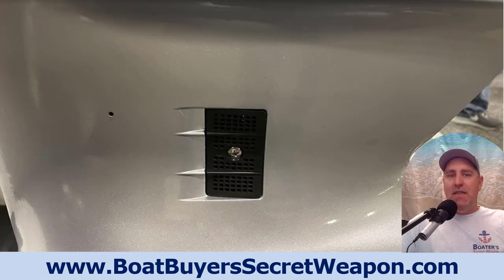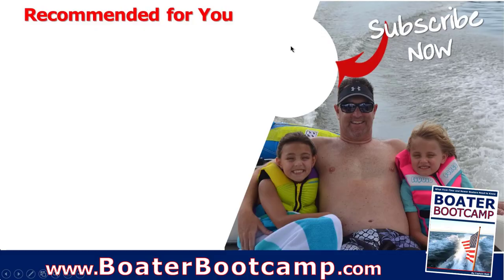And then you have this little piece on your lower unit. This is actually the water intake. This is where the impeller sucks in the water from this source. You can see this is the front of the lower unit right here. That water is going to flow through there. It's going to suck it in to cool the engine, and it's going to be sucked up by that impeller.